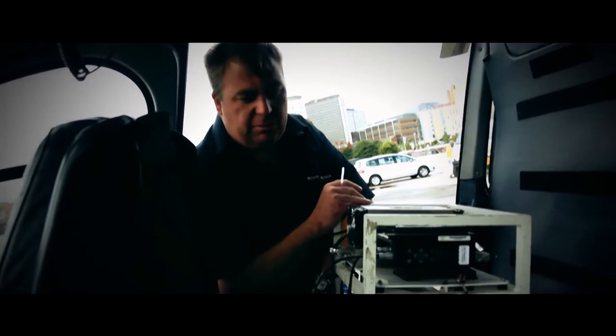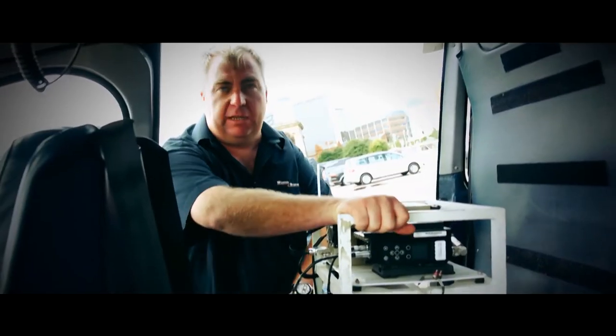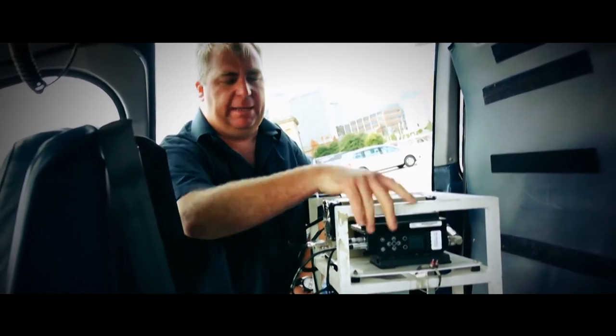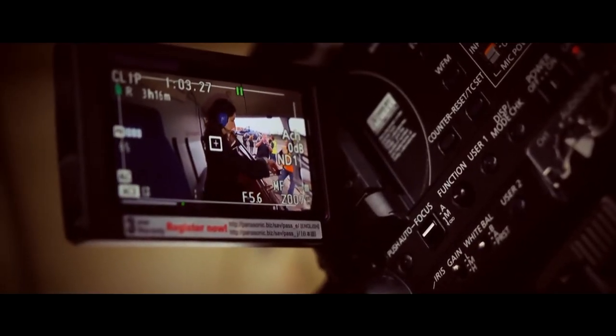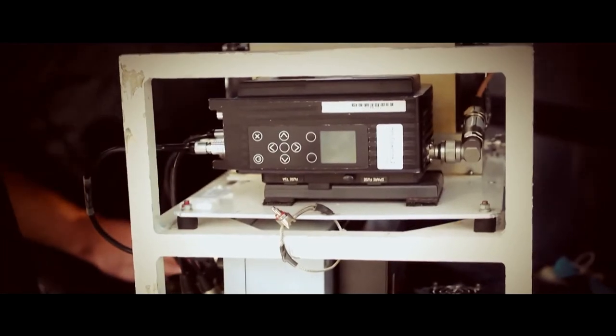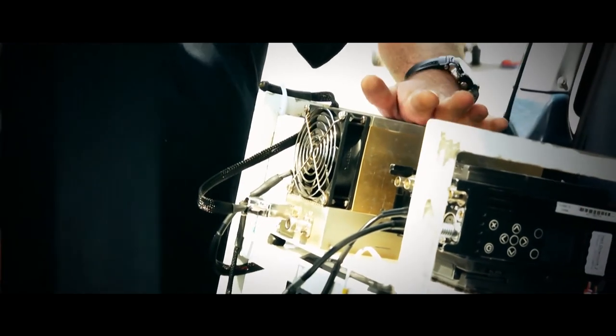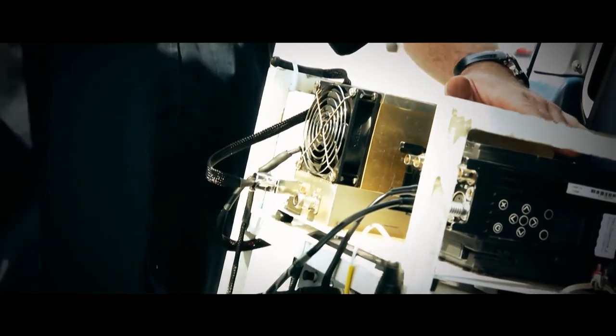We're basically bolting in all the downlink equipment. All our live video feed and all our audio are coming down on our transmitter. We bolt in the equipment frame so it's out of the way of the player. We take our video signal from the camera into our transmitter, mix it with our audio signals to make one signal, and put that on a modulated frequency — it's a very low signal so we boost it up as we're transmitting quite far distances.